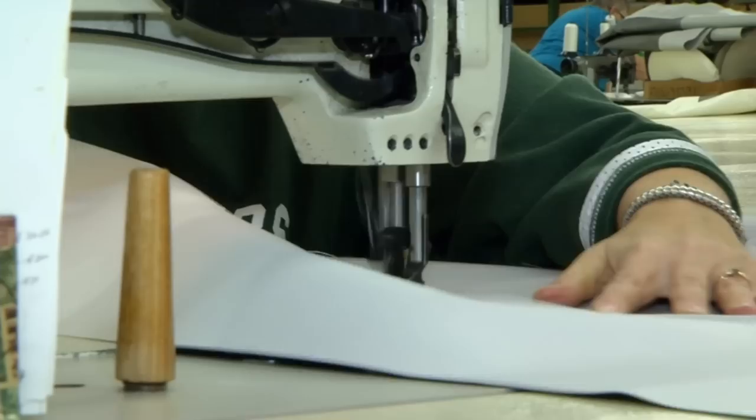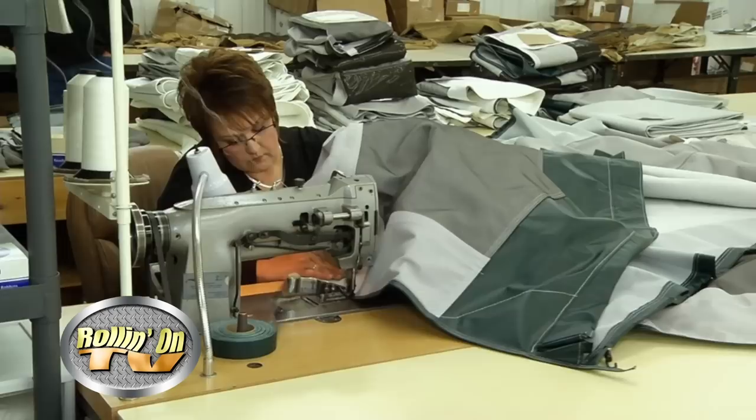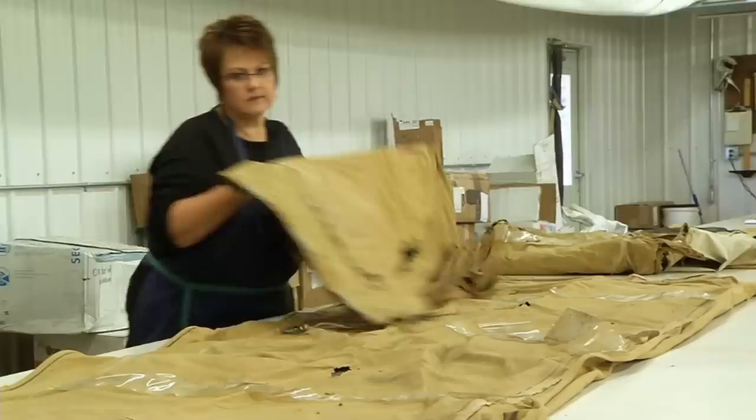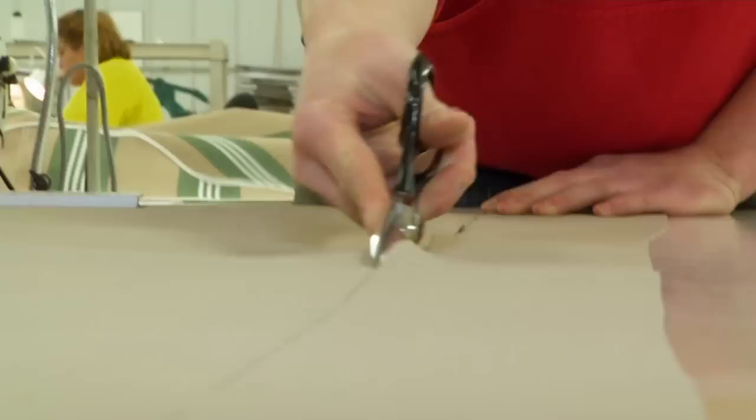As we saw earlier, there's a lot that goes into fabricating a brand new canvas for your tent trailer. I asked Bob to explain the various operations that go into making a new canvas replacement. When a customer sends an old tent in, the first step beyond writing up the order is to spread the old tent out and take measurements. An expert will measure everything out, do sketches, make notes of how things need to be cut, what the finished sizes need to be. In some cases, they do make a partial pattern of different intricate parts and, if necessary, take the tent apart so they know all the angles of each seam.